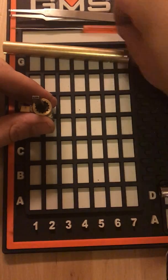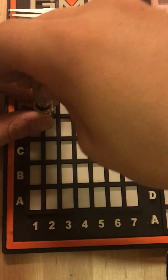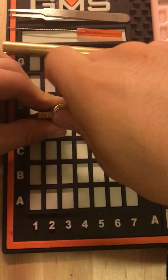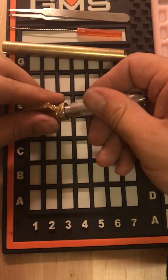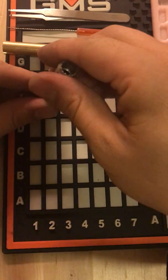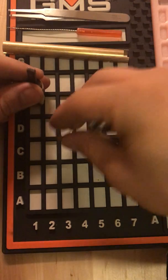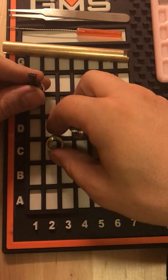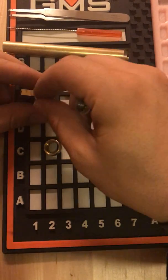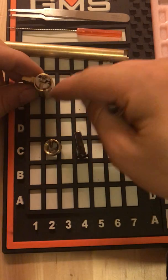There's also this thread cap removal tool, which fits over the tail piece, and you can just spiral it on. All done. If you're doing a lot of them, this tool really helps. I do it the same way every time when I service cylinders. First, I pull the thread cap off — that goes in a spot, I usually make a cup out of it. Then I set the tail piece to the side, put this in a little cup, and knock the spring out. Those tend to stay in one little group.